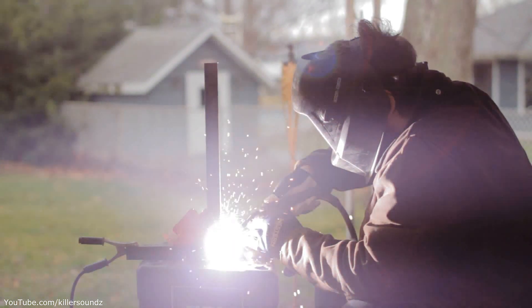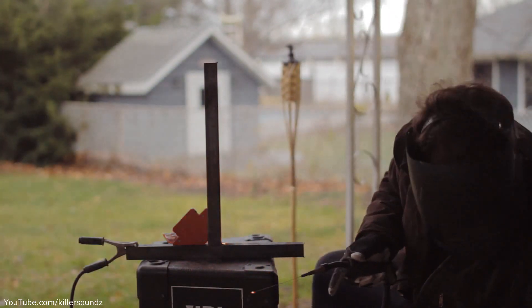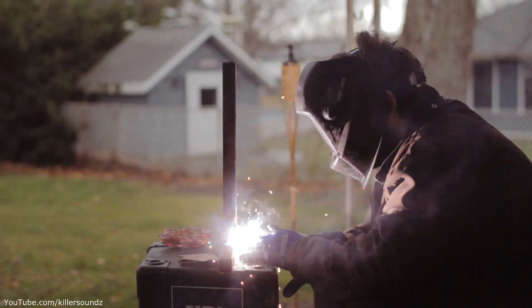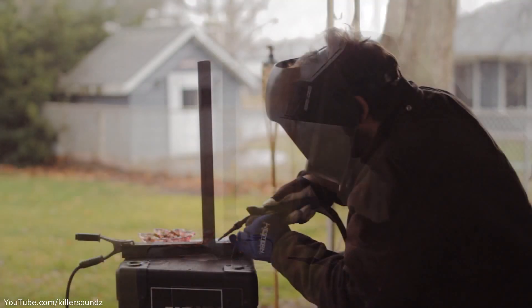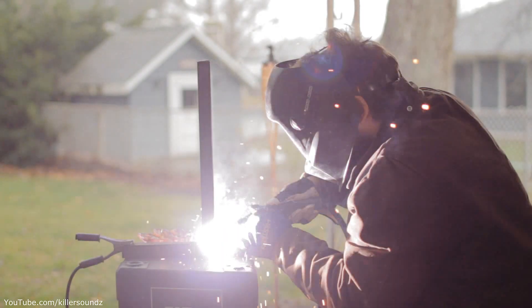This is inch-and-a-quarter tubing, 14 gauge, and I'm using this cheap Harbor Freight welder. It doesn't weld very well — especially with this thin gauge material, it'll blow right through it. So you have to weld a little bit at a time, stop and let it cool off. But it does the job for this. Honestly, it's flux core — pretty much anyone could use this if you ever want to get into welding. It's pretty easy.